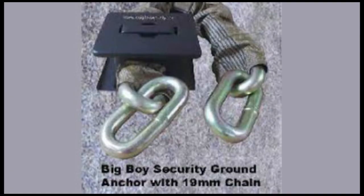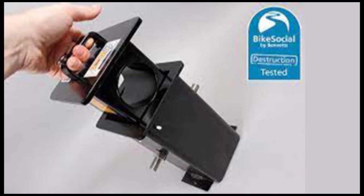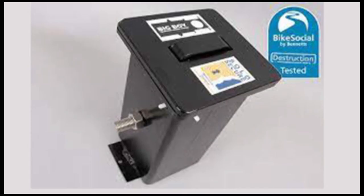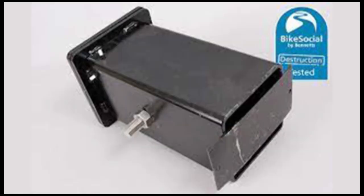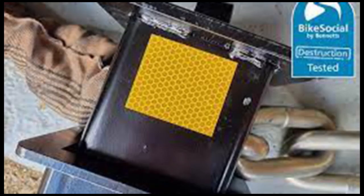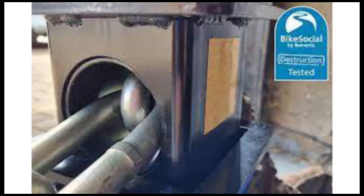While about half the unit is fixed into the concrete, this is still a hefty thing to lift. The handle drops down into the top of the lock, which while it can be a little fiddly with thick gloves on to grab, is a good compromise in order to keep it from being a trip hazard. The previous design had a machined recess, but this was removed as it made that area thinner. The ideal would be a pressed indent, but this can't be easy on 8 mm steel, and it'd likely hold water. Once your chain is passed through, the unit simply sits open, with nylon pegs keeping it from rubbing on the sides as it's lifted and dropped.